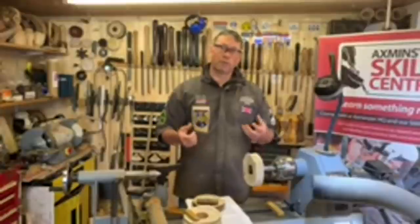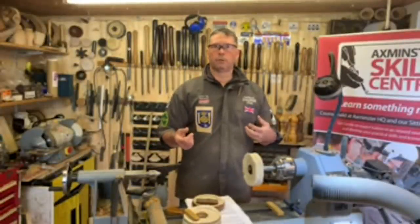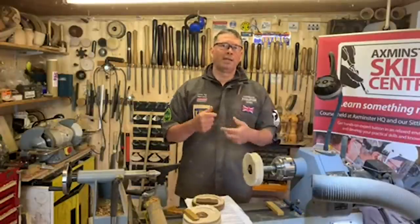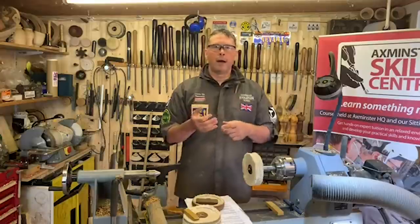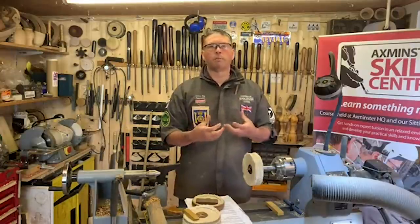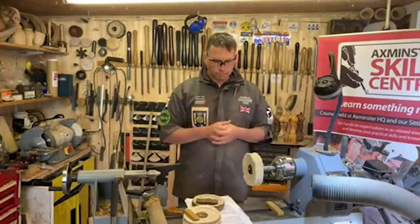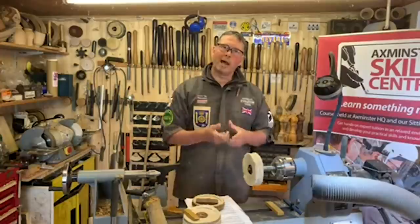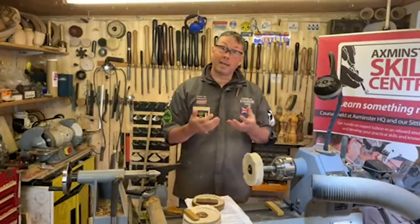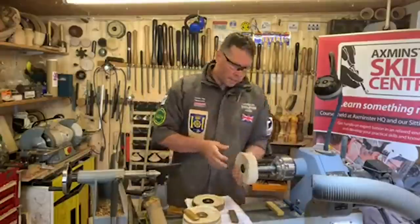If you want something to last in terms of a finish, say for instance you're doing a light pull or something like that, or a bottle stopper, then you'll need to have a hard resistant surface there. So something like a lacquer, like a varnish type product, something that sets hard. Oils don't, they're a breathing, living sort of finish. So you will wear them after a while if they're continually handled. Think of all those acids in your hand, sort of thing. So I hope that's answered that one.